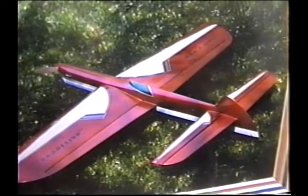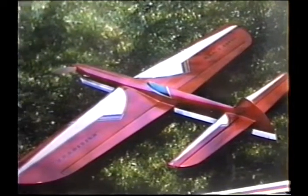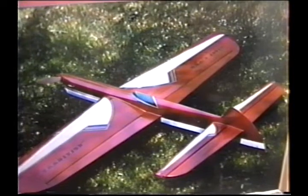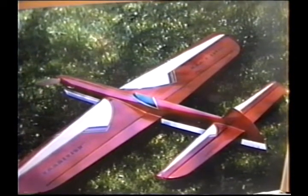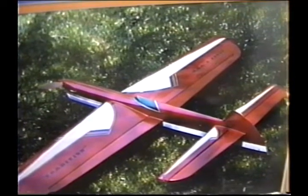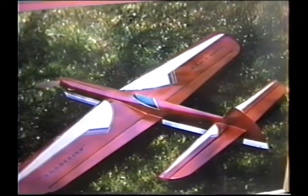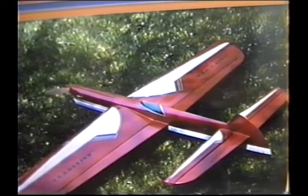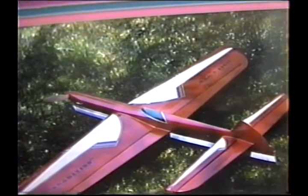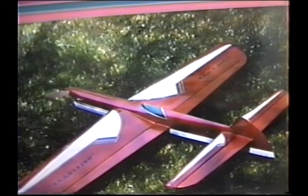That's one of the advantages of a foam wing type plane or a plane with all wood surfaces and no tissue, no open bays — at this point there's really a monumental saving. What we're going to be developing in the next couple of months after finishing this plane is a carbon fiber Nomex wing in one piece — Midgley already has the Nomex in-house. That should be the best of all worlds: no finishing, no tissue, prime it and paint it. I don't know if we'll get there, but we'll try.